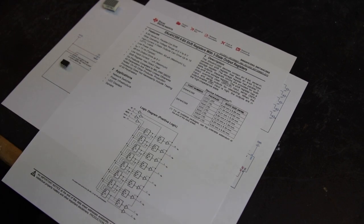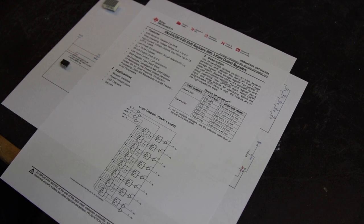We're also going to use a CMOS chip, which is very useful, the SN74HC595. It's basically a serial to parallel converter. They're very useful as digital output multiplexers, for example. With only 3 wire communication with a PIC, you can have as many digital output ports as you want.